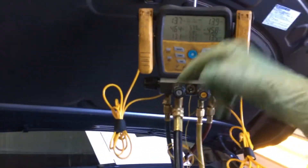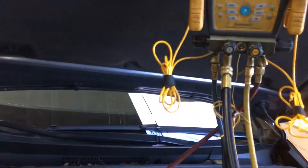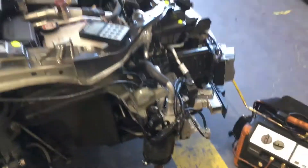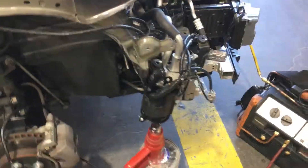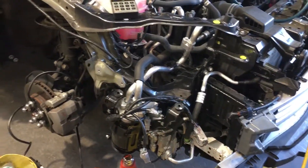Even though I was under a negative vacuum, that does not mean you're empty — refrigerant will stay a liquid when it gets that cold. Once you get below minus 22 to 27 degrees temperature internally, plus you have insulation on an accumulator, it will stay a liquid on a cold day if you're in the 40s, 30s, or 50s. It'll just stay there.